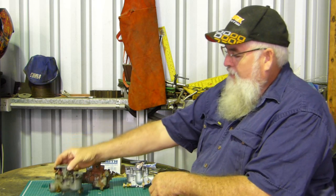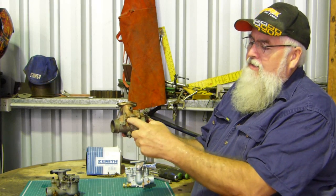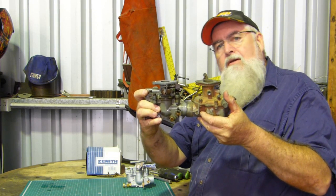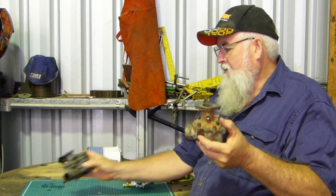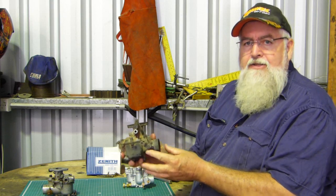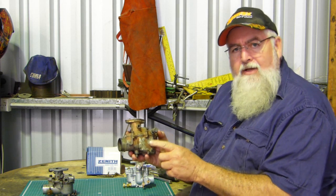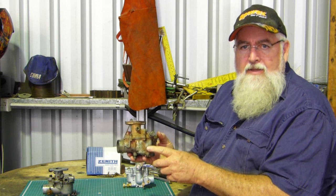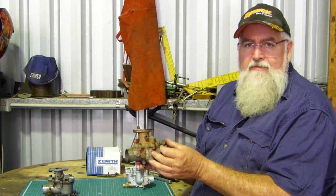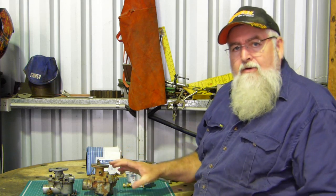Now, if you compare the 24T here to the later model on the TE20s, which is the 28G, air cleaner still here. It has a bigger hose, so I think you'll find that one of them has a stepped hose and one doesn't. The 28G carby, this is off a Gold Series Gold Belly 35. The 28G was used on the very late TE20s, then on the 35s, the petrol 35s, right up to the 135s, I believe.